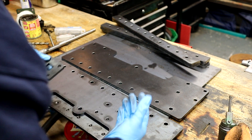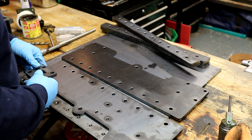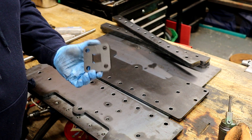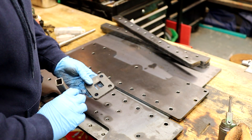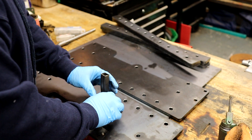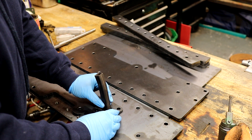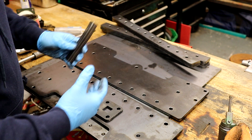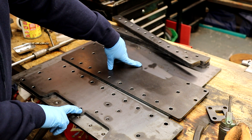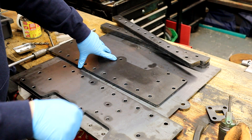In addition, we're thinking about how to wire up the milling machine and how to fit a digital readout if we want one. You'll notice on one of the plates we've got four holes positioned for a base plate. This base plate uses a 25 by 25 millimeter box section that can be welded onto it and then bolted onto the base, giving a bit more rigidity as a bolt-on accessory. The holes on the sides and forward part also give the option to move it with the wheeled puller.